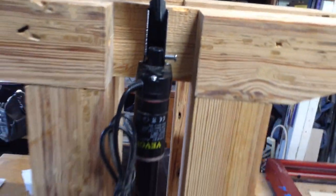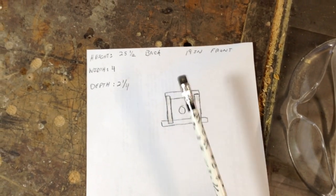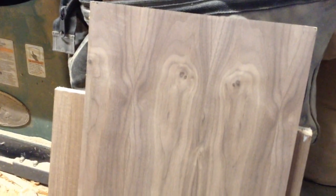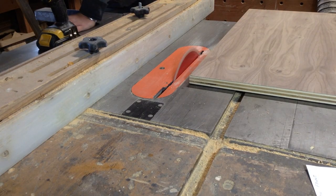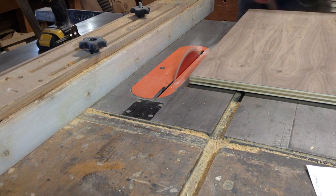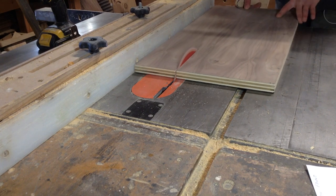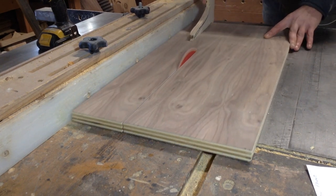At this point my opening is four inches — about two and a half inches deep — and the design is basically a modified I-beam system for strength as well as keeping the cradle true as it raises and lowers. There are two contact points: the groove the whole thing rides in, plus it sits in the front, which eliminates side-to-side movement as well as front-to-back movement.